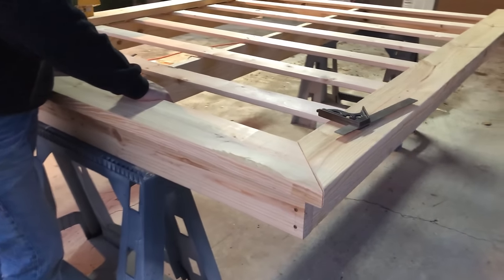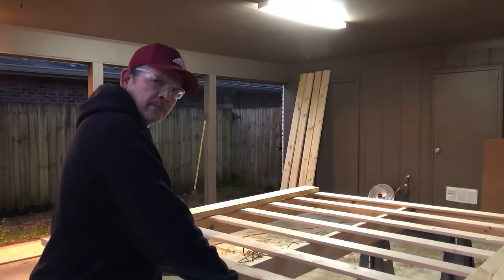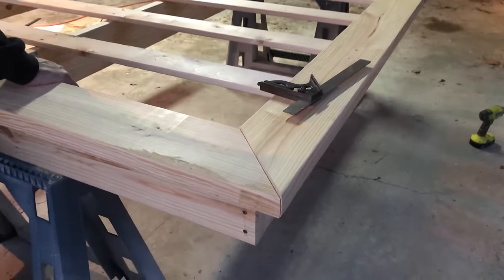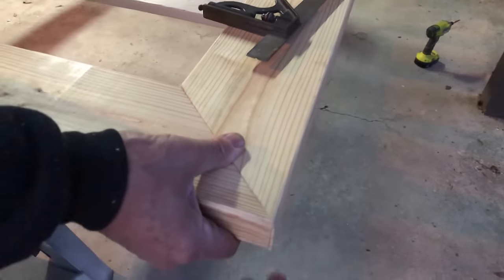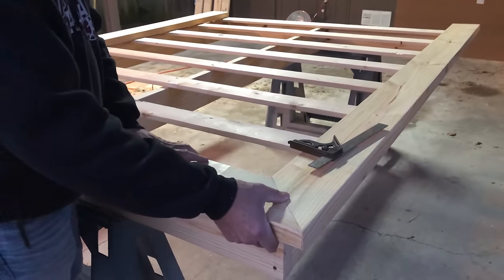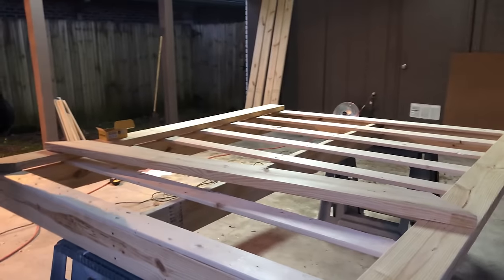The miters are cut and it looks absolutely amazing. We cut it a little long and kept shaving material off — you can always take off but you can't add more wood. It fits really well. If it's a little long, another approach is to only secure it at the top and leave the front corner slightly floating — you'll never be able to tell it isn't perfectly 90 degrees, and it'll match up nicely. The grain looks like it's matched — almost like one piece of wood.